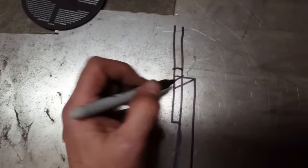And like before, just tack weld it. Every bit, watch your heat. Use the blow off on it to cool it off if you have to. Make sure you can touch it with your bare hand, and then that'll stop all the warpage. I'm going to go weld it all up there now. Cool off and touch it there, or cool it between each spot weld.